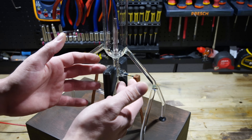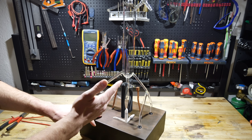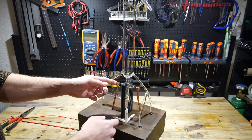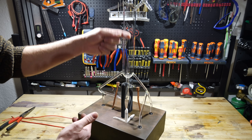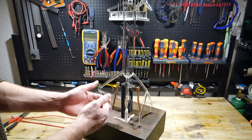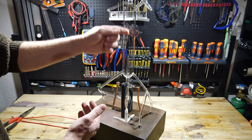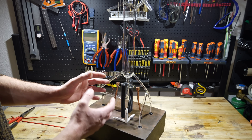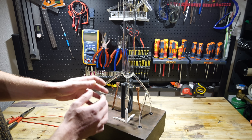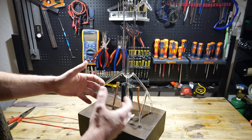The working principle is very simple and it's a really cool concept. As you have seen in the video, there are two major problems with this fountain — actually three, but I haven't told you the third one yet. The first problem is the power supply: it shuts off because it detects a short circuit and then turns on again, so we just have this intermittent fountain. I will resolve this by either using a different power supply or by using resistors so the resistance is high enough that the power supply does not detect a short circuit. The second problem, and in my opinion the worst one, is the mineral oil inside the fountain and also that the metal oxidized a little bit. I think the oxidation is due to the oxygen and moisture inside the mineral oil. Either way, I have to think of a good way to fill this — I know a good way, but I don't have the material here or simply don't have the space to assemble everything.